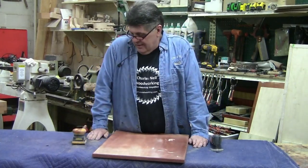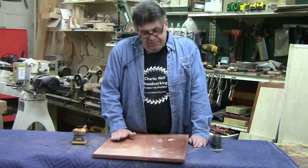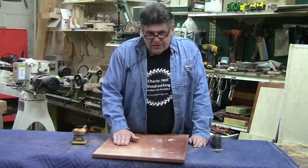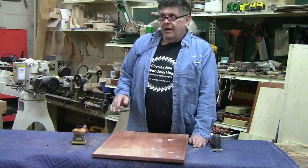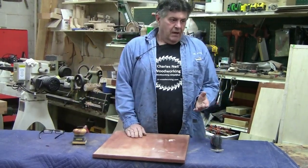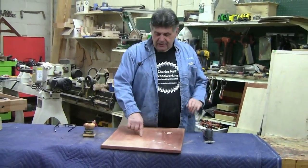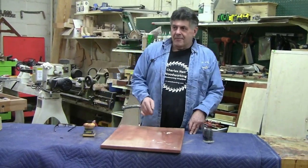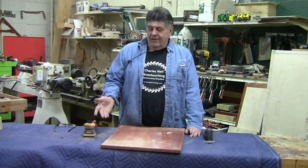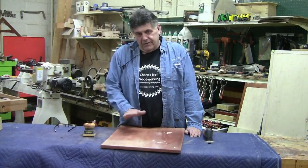The issue with these is the short stroke. What happens is it's just a little quick hook. If you've ever sanded something with one of these and then put your stain on, you get to see these curlicues — we call them squigglies — and they kind of look like a fish hook. These are notorious for creating that. Again, it's the stroke.